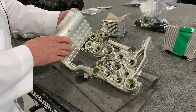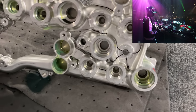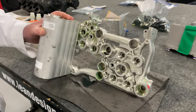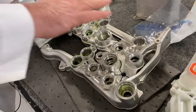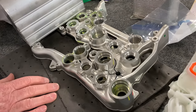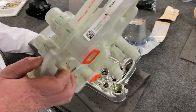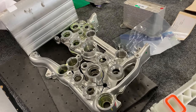One other cool thing is the use of EDM — electric discharge machining — to cut these different shapes out so that the manifold itself can breathe. It has to be able to move because as things get hot or cold — and you can have a combination of both inside this unit — they need to move around a little so they don't break free or cause leaks. I really do like the fact that they've used semi-solid forging. It's an excellent way to manufacture a product that won't have porosity and won't give you failures in the future. The part is also machined accurately enough so that when the plastic manifold goes over the top, sliding it in will be no problem — everything fits like a glove.